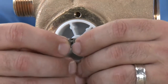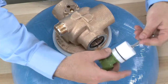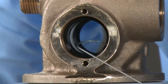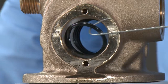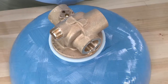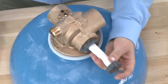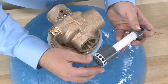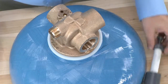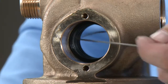Bringing our drive pin link back into the piston shaft, we can pull forward to remove the piston. Once the piston is removed, we have access to remove the seals and spacers. Using a hook tool for the seals, we can pull them out. We then bring in our spacer puller tool. We put this in the bore of the piston and press down on the lever. There are three pins in the lever that hold into the holes of the spacer. Pulling it loose, we can then remove the spacer. We repeat using the hook tool for all of the seals and the puller tool for all of the spacers.